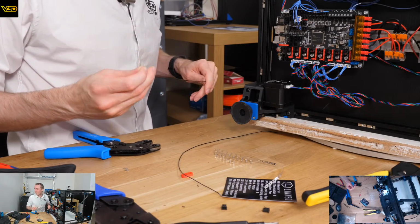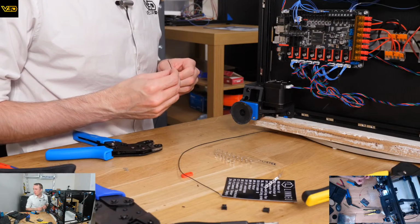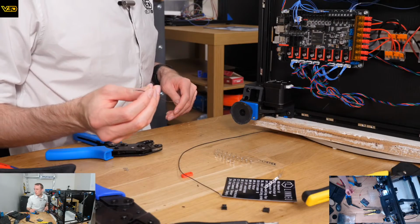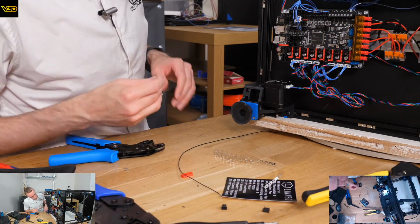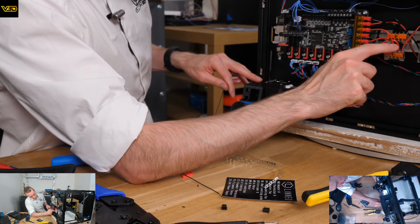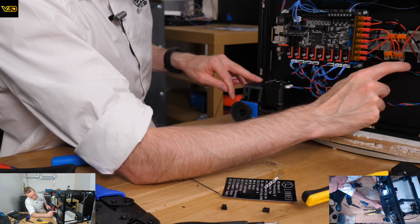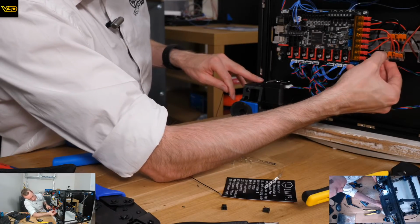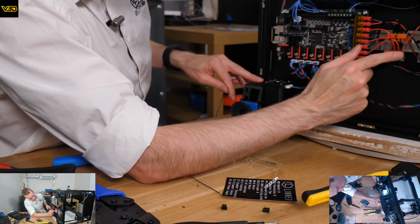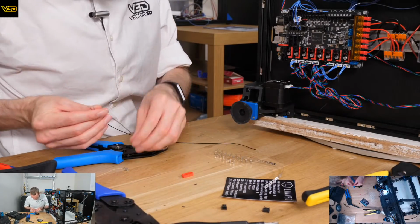Oh dear. What is the last clip on the Wago with the red wires unlatched? I'm joining late. But is the last clip on the Wago with the red wires unlatched? This one here? It does look like it, doesn't it? So there's quite a lot of slack in these. They move quite a lot without any force. That's just general wiggle room, and then they take quite a bit of force to actually fully open. And then they clip closed. But yeah, they do wiggle quite a lot. They should be genuine Wagos though, so presumably that's normal-ish.